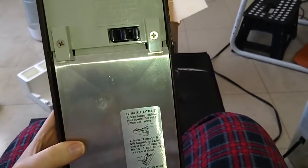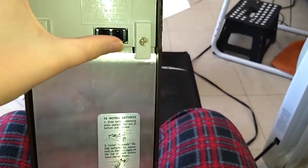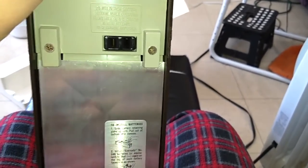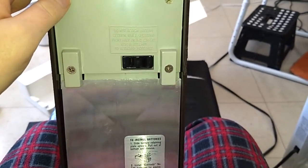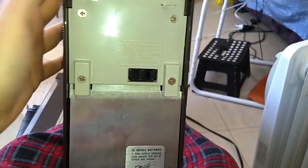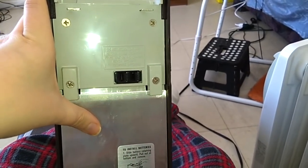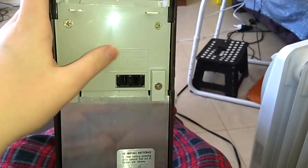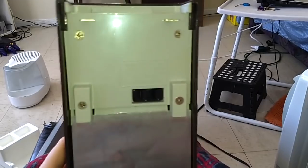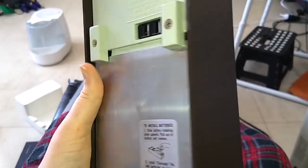And yeah, as I said before, they have to put the resistive ballast in the battery compartment itself instead of the main unit. And that's also a good thing, because if you were to plug something else into this battery compartment while the batteries are in it, the resistor will make sure that there isn't an excessive amount of current flowing through whatever you plugged in, because you're dumb. If you were to, for example, plug an electric fan into this and the resistor wasn't there, the fan motor, you know, is just an inductor. An inductor is a very low resistance on DC current. You'd be shorting everything out, possibly ruin your batteries, possibly ruin the motor of the fan. But with that resistor in place, that's not going to happen. 600 ohm resistor. So yeah, that's good that they put it in there, even though it was a required part of the design anyway, because of how they designed the unit. But there's your battery compartment.